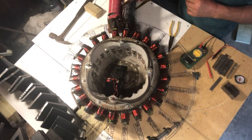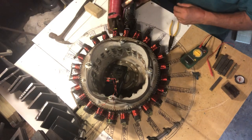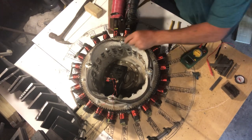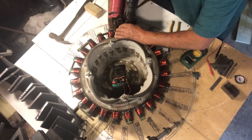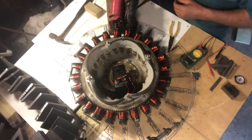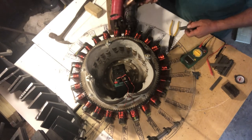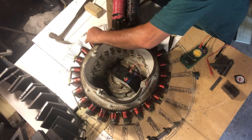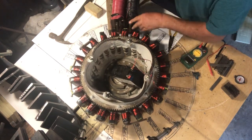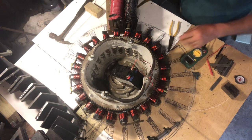The goal is to saturate that magnet again and realign the molecules. You can see the coils pulling themselves back. I put a 12-volt battery in and connected the wires up, and just as I said, it pulls 19 amps through — and the wire doesn't even get hot, so you can leave it connected all the time.